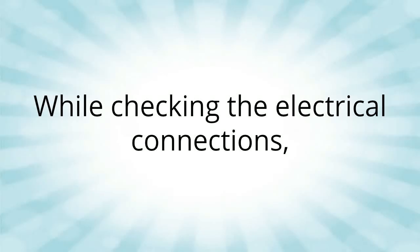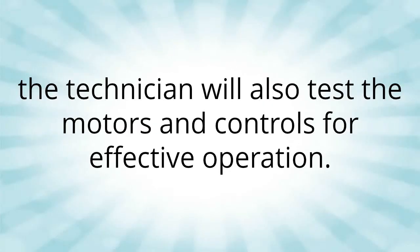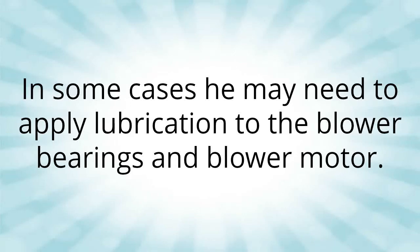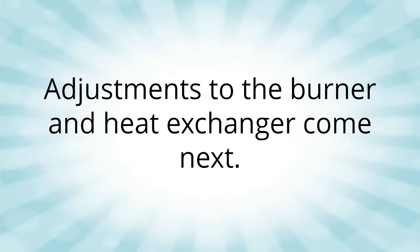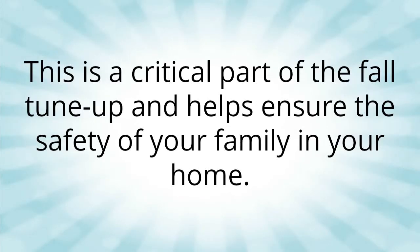While checking the electrical connections, the technician will also test the motors and controls for effective operation. In some cases he may need to apply lubrication to the blower bearings and blower motor. This is a recommendation by the manufacturer and it is best to stick to these recommendations. Adjustments to the burner and heat exchanger come next. This is a critical part of the fall tune-up and helps ensure the safety of your family and your home.